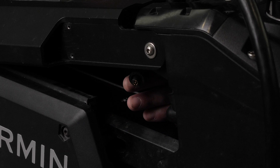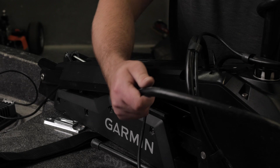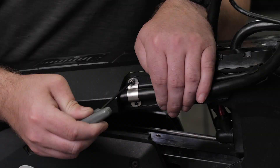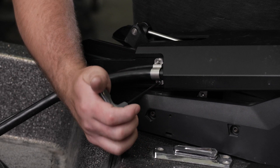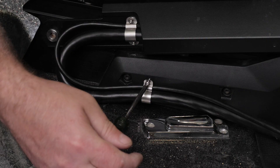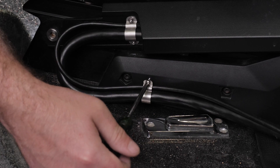Then, connect the cable to the display panel on the upper link of the mount. Next, route the transducer cable through the channel on the side of the mount and back to your chart plotter. Then, route the power cable through the channel on the side of the mount. Now, using a 3 mm hex bit or wrench, use the screws we saved to secure the two brackets to the cable channel on the mount. Finally, using a number 1 Phillips screwdriver and the screw we saved from earlier, secure the upper tab of the cable bracket to the mount base.